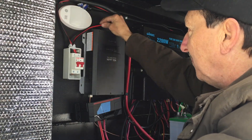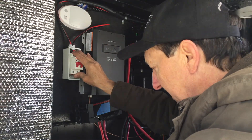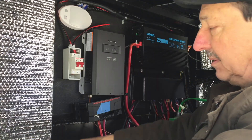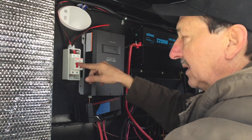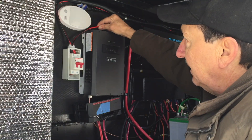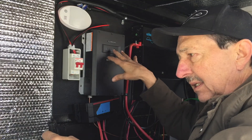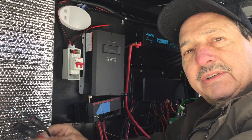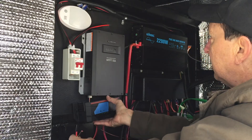It wasn't easy getting these wires — not a lot of room to work with — but I was able to get them in. It has a track system on the inside of the case that just snaps in, and then I can run my wires up to the bottom with a nice cover. It's a good way to control overloads with a built-in breaker and to disconnect for any service work. By having that external plug connector on the inner compartment, I can push the wire down through the shelf holes — no plug exposed on the outside of the trailer to get dirty or damaged.